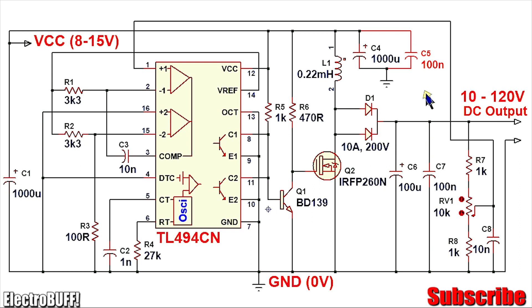As the output voltage rises, the voltage at the feedback point will increase to slightly above 5 volts, which will trigger the first error amplifier, giving a positive output and causing the output duty cycle to reduce — stopping the output voltage from rising further. By adjusting the potentiometer you can adjust the output voltage up to the desired value. Capacitor C8 filters the feedback voltage to the amplifier to prevent any accidental triggering — it's a 10 nF ceramic disk capacitor.